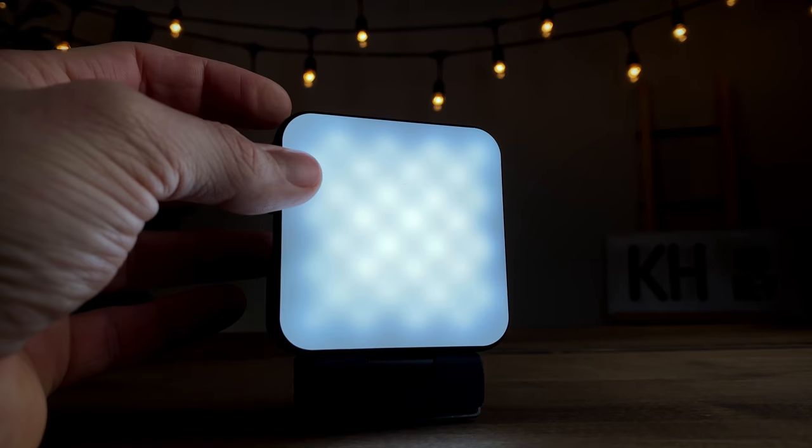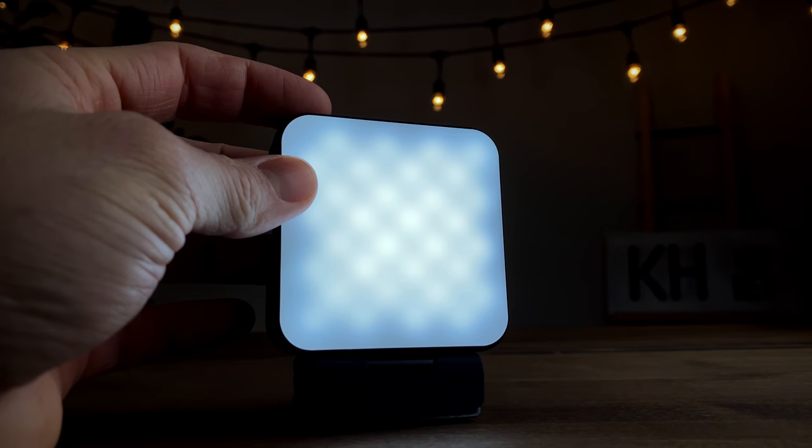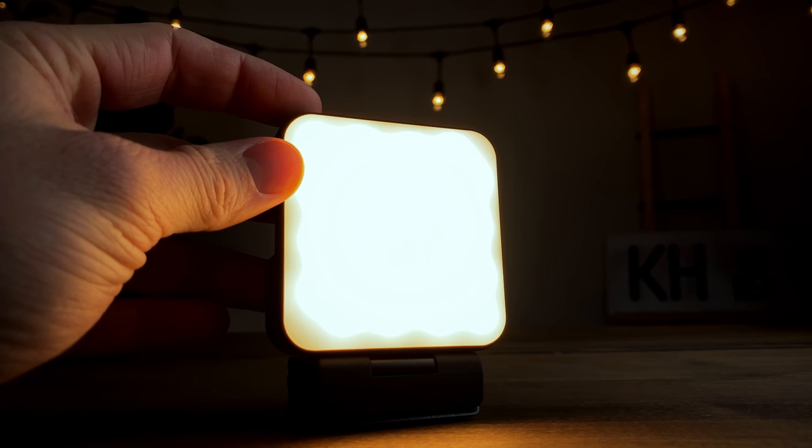This light is capable of producing both a warm temperature color and a cool temperature color. Color temperature is measured in Kelvin — the higher the Kelvin number, the cooler or more blue the light will look, and the lower the Kelvin number, the warmer or more orange it will appear. If you're in a room with soft warm lights like I have behind me, you'd want to use warm tones to match your surroundings. If you're sitting by a window and need fill light, you'd use the higher Kelvin cool tone to reach a perfectly balanced light.